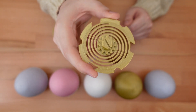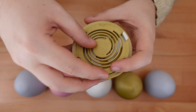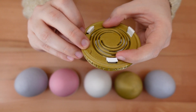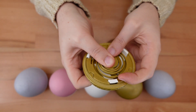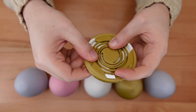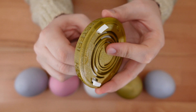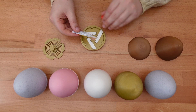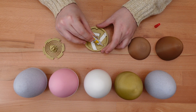Next, we're going to test fit the spring. Even with the latches pushed to their outermost position, the gear in the spring won't mesh with the gear teeth in the latches — this is intentional. This is where we pre-tension the spring slightly until it slides into place. Then a little super glue around the edges will hold it. Just make sure not to get any glue near the latches, or the box won't be opening at all.